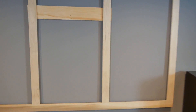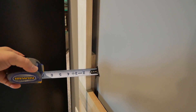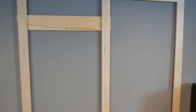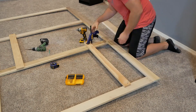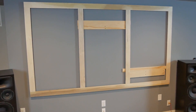One thing I did want to point out: if your wall is not completely flat or if you have a little bit of warping in your wood, once it's spaced out you can see one side is about three-quarters of an inch from the wall while the other side is pulled out about an inch and a quarter. So what I'm going to do to fix that is make another cleat in the center and put it down here in the lower quadrant to pull it closer to the wall. I attached the cleat first to the frame, then came back and attached the lower part to the wall. This ensures the height isn't altered and only pulls the frame closer to the wall.